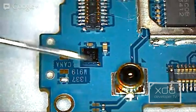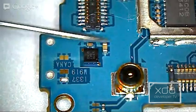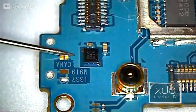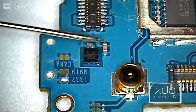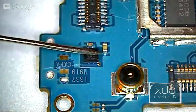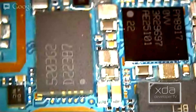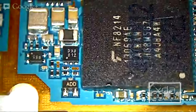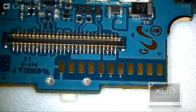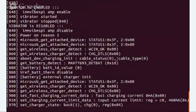These each represent a binary number — a one or a zero. This is ground over here, and then we have a pad that you could solder a resistor to. It goes straight across and then goes back out to ground. That doesn't make a lot of sense. We have ground on that side and ground on that side — so what is the purpose of this component? This would be a debug port of some kind, and the debug port is something that I find to be the most interesting part of the device.